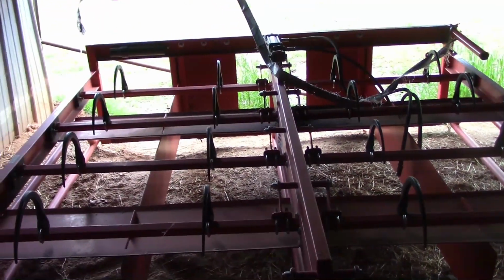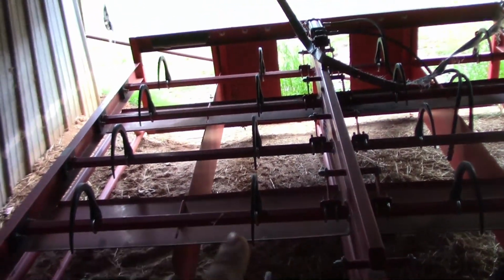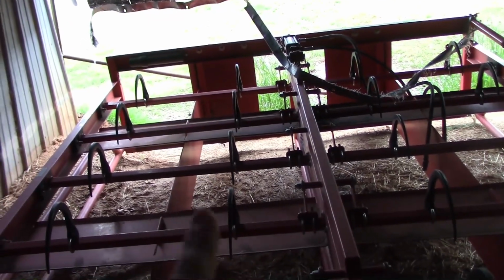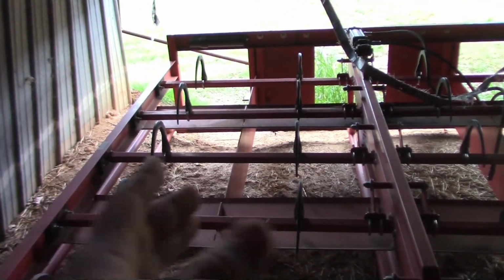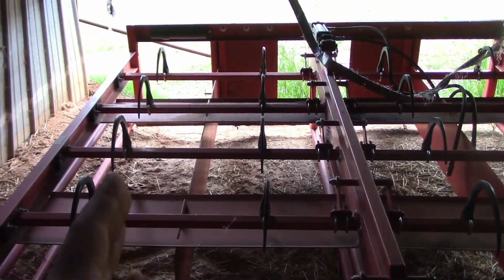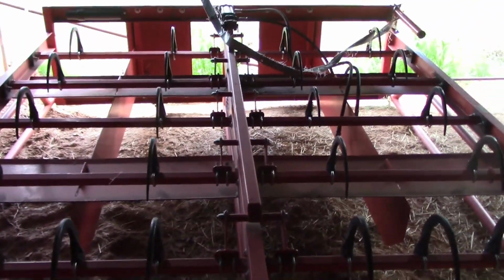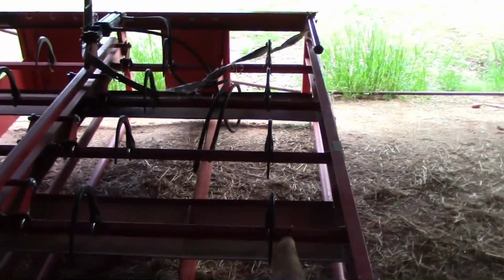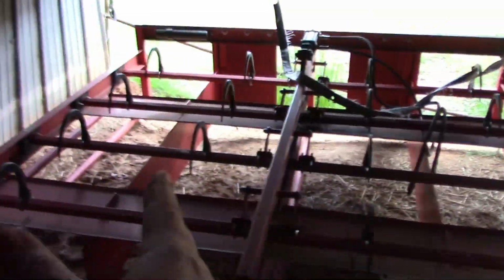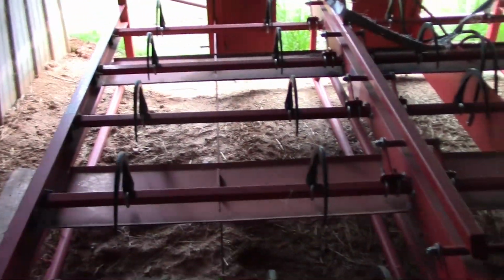Now you have to take all those out, and when you take all those out, when you grab a hold of it to get it tight, your hooks are going to be off. Your hooks have to be set to pick the hay up without any pieces in it, and they have to be offset so much. Now I'm going to show y'all what the offset is by this other grapple I have behind me. This side, if you'll notice, each one of these is centered right down the middle of their channels. That's the way they should be to load with it like this.